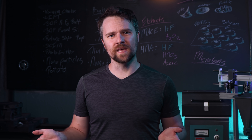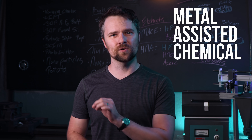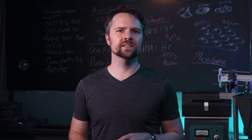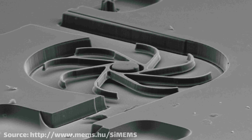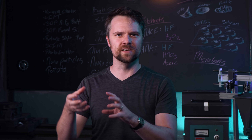This project starts with a different technique I was attempting to get to work called Metal Assisted Chemical Etching, or MACE for short. This technique is used to etch silicon in a very selective manner, and you might want this if you're making MEMS devices, accelerometers, gyros — anything that needs silicon etched in specific geometric patterns to make a three-dimensional structure.